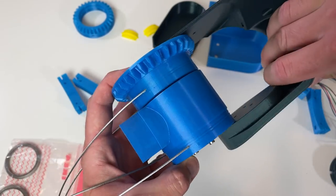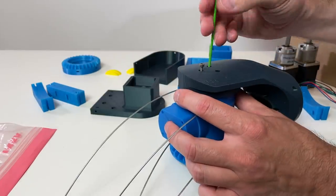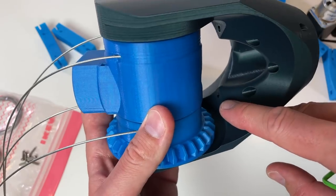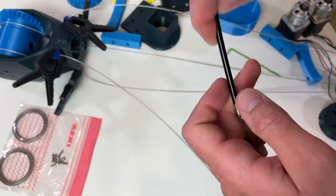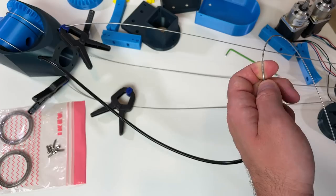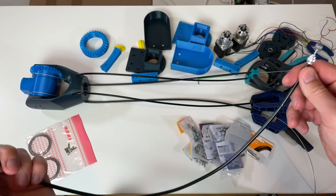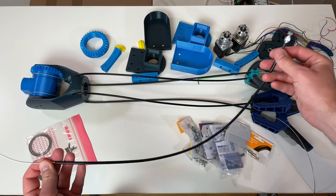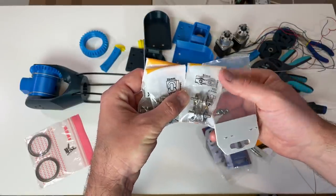Next we put this assembly into the wrist, keeping the axis vertical. Now I'll put the cables into the appropriate holes — two holes here and two holes there. This cable runs on the outer side. The Bowden tube has a length of 55 centimeters, and the cable goes inside it. On one side I'll secure it with a bigger clamp. Before continuing I want to make a small test: I'll put the tube straight, fix one side rigidly, and see what happens when I bend this Bowden cable.